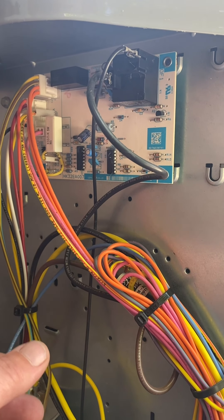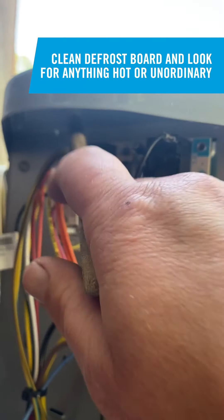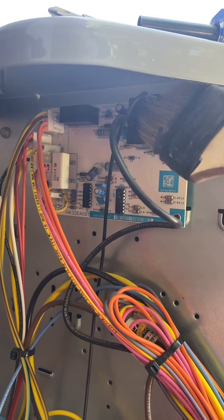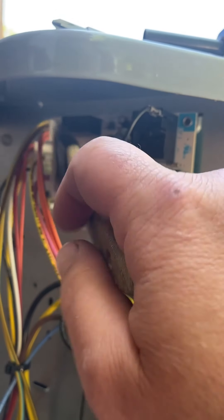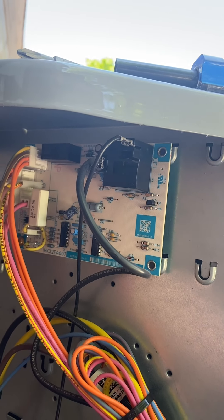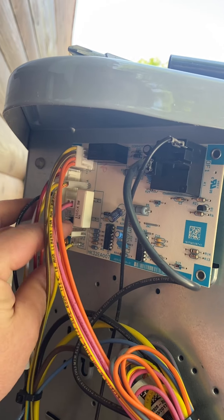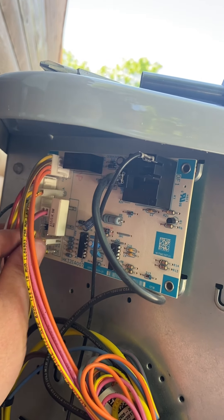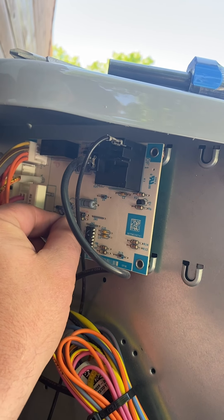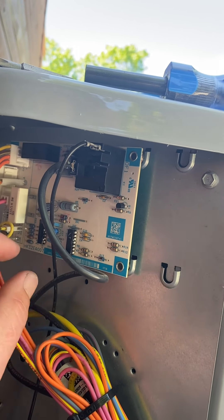This particular condenser is a heat pump and it has what we call a defrost board. With the power off, take your brush and clean any spiderwebs or bugs accumulated around the defrost board. Put your hand on these connectors and make sure they're good and tight. Also make note of any visual signs of anything that looks off, getting hot, or burnt — look at the circuit board and its components for any signs of damage such as brown spots.